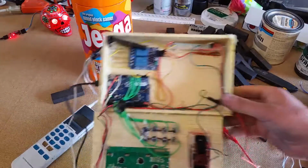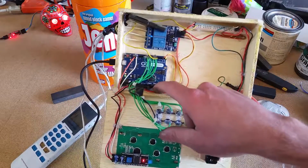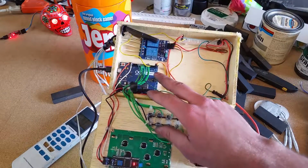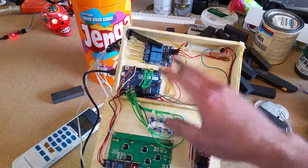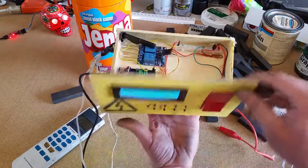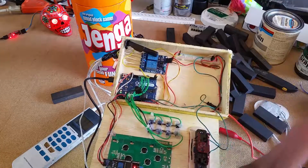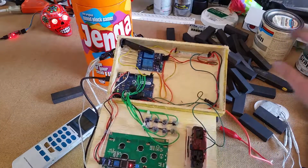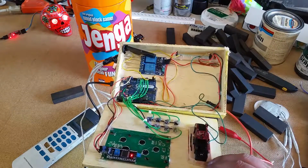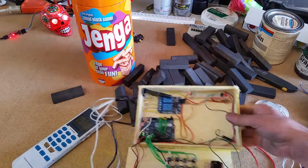And it's not easiest to see, but this is the capacitance lead wire coming into, it's actually leading off the analog port, because we're able to get this library that just needs one port. It's pretty cool to read capacitance on. And programming this guy is just kind of a state logic setup, just a bunch of if statements for running this game logic. It's not super complicated. I got the sketch linked on the GitHub. It's quite straightforward.